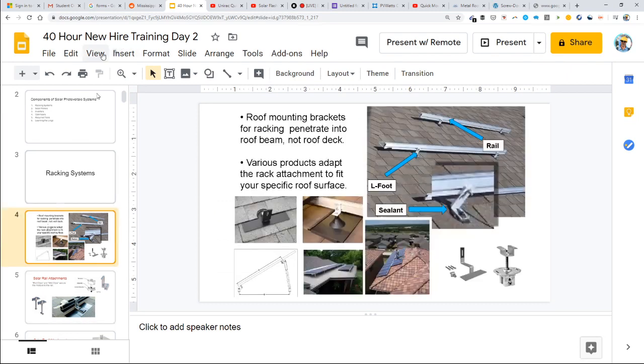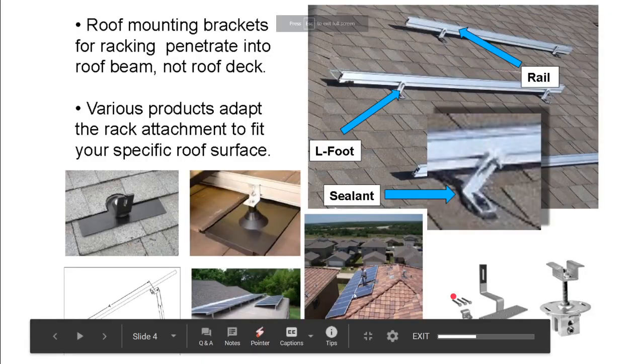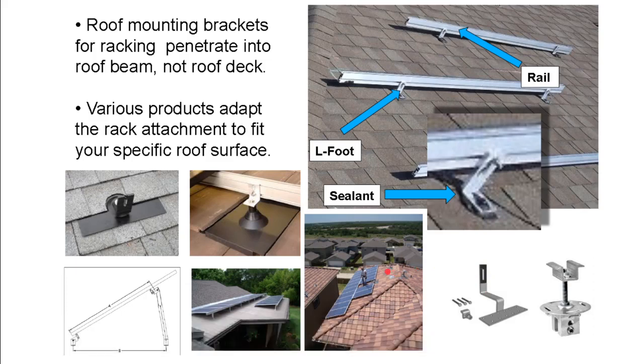So here's that, that might make this little racking attachment make a little bit more sense now. Here's the plate that would be screwing on to the batten, and it gives you a little bit of freedom on where this is actually placed, so that you can place it coming out the right spot of the tile. But then this lifts up inside and then sneaks out of the tile, and then gives you that L-foot attachment point afterwards.